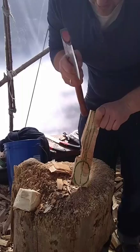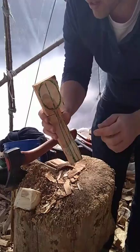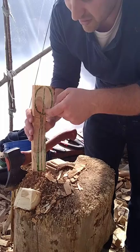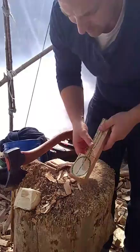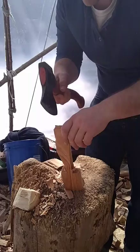If you carve like a half a branch where you start with the bark side on the underside, you end up with that funny thing where you have lines up here and then lines down here and then this amorphous thing in the middle. I don't like it as much as having concentric circles. So that's why I do it. I also think that it's marginally less strong, although I think it's perfectly possible to carve a spoon that's strong enough that it'll never have any problems.